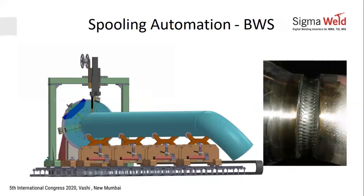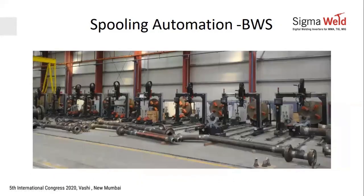For spooling automation with larger pipes — pipe-to-pipe, pipe-to-elbow, pipe-to-fitting, reducers — both root passes and multi-pass welding are required. For example, on a 50 mm thick pipe, multiple passes are needed on top of each other. AVC, weaving, and the wire feeding arm can be applied in this configuration to achieve consistent weld bead results, with reduced welder skill requirements.